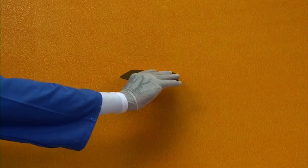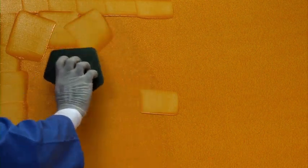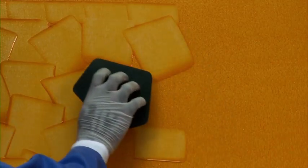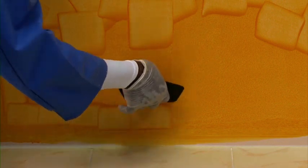Apply glaze on the wall to create the effect. The spatula should be held in the correct position. Before making the effect on the wall, take care of ceiling and the sides. Apply squarish strokes in a random manner with even pressure, from left to right and top to bottom sequence. Take care of the skirting areas by applying reverse strokes first and then finish the balance areas.